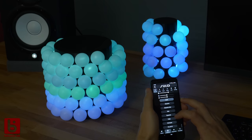Electronics next. Since the male connector from the end of the strip isn't used, we can cut it off and use it at the front. Some electrical tape prevents unwanted shorts here. We can solder the connector to the microcontroller to be able to connect it easily to the front of the strip. I use the Wago wire nuts to connect the 5V and ground wires again.